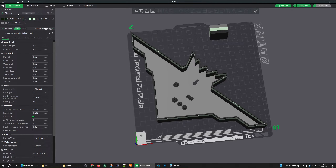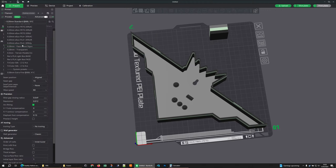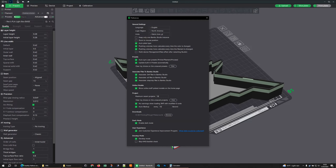When you have filament profiles like my AnyCubic here, you can also have process profiles. Use process profiles — don't try to set every value every time for every print; you'll miss something and have a bad print. In my case we're printing the base of a light box and I already have a base profile saved and ready to go. I just switch over to that, and it changes so many things at once. First, go to the little arrow next to File, go to Preferences, and turn on developer mode — you want this if you want to see all settings, because some things are hidden by default that light boxes actually need.